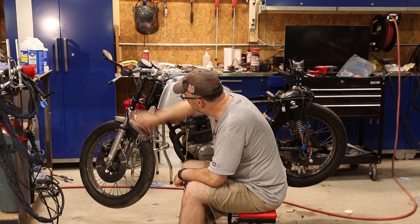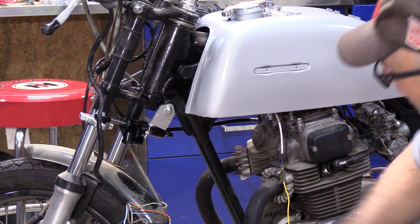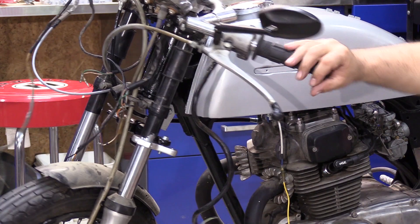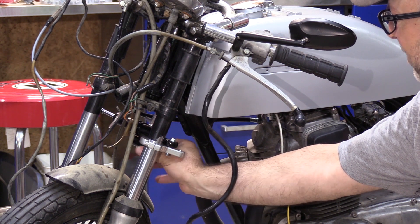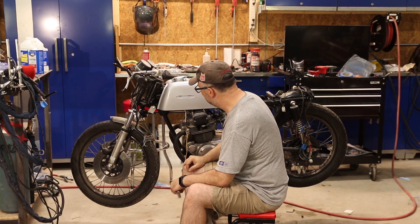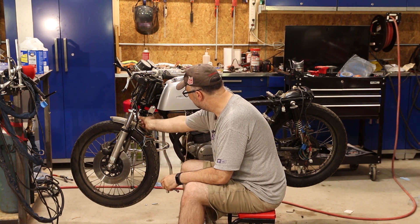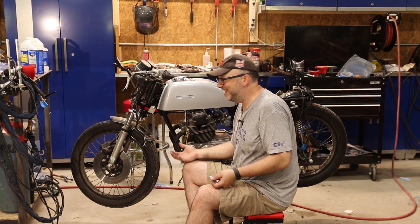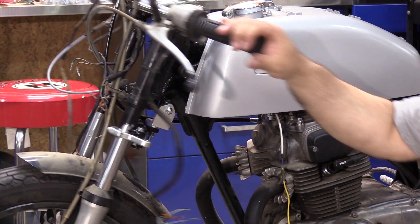That wasn't as bad as I thought. It's one of the things I've been pondering for a while — I want to make sure I find a good way to mount this. The steering damper is pretty important at high speed. The concern is if you get a little bit of a high-speed wobble, it could amplify at just the right speed and you really don't want to death wobble at high speeds. Granted I'm on a classic 200cc motorcycle so high speed is relative, but I can see why they make it a rule for all classes.